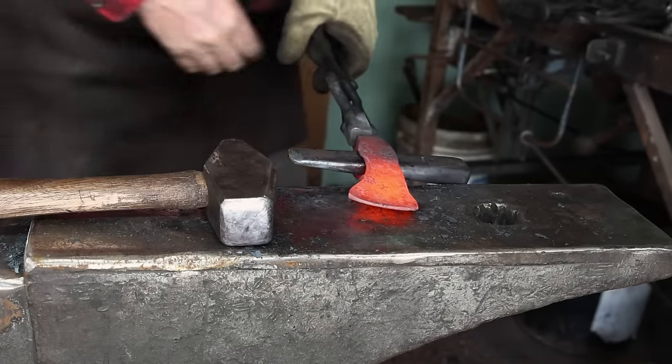After shortening the cutting edge, I've got more material than I need for the spike, so I'm going to go ahead and cut the spike off to help balance it a little bit. Now remember, try not to cut all the way through in the hardy — that's a good way to damage your hammer or the hardy. I screwed up on this one.